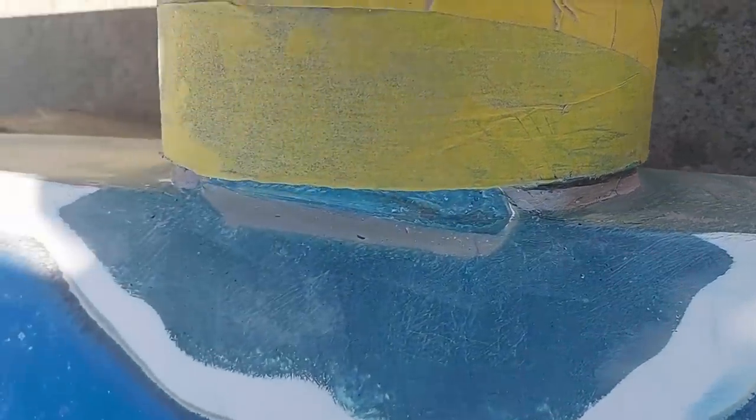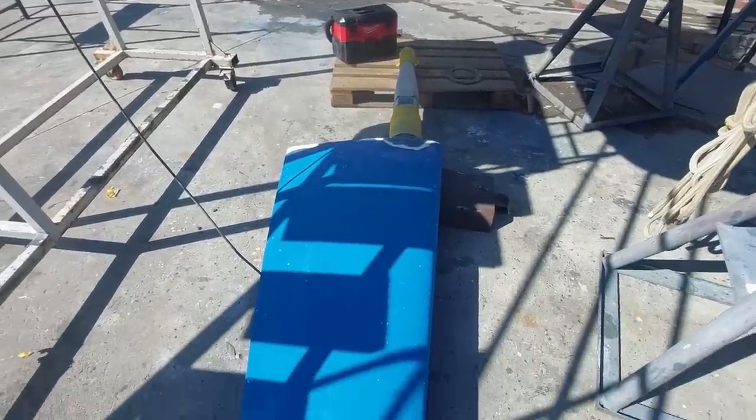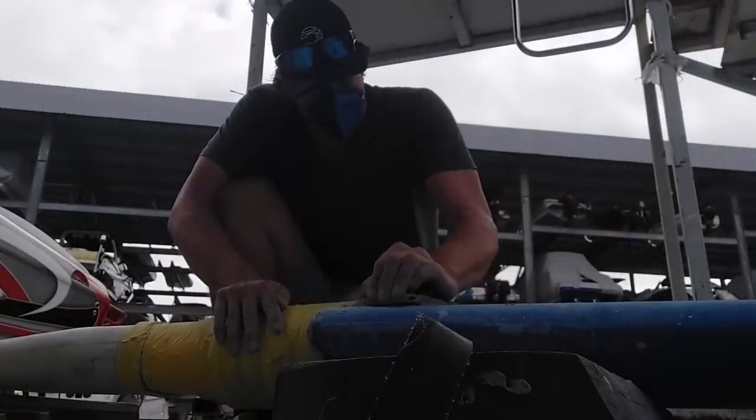There was just a little bit of absolutely normal cracks and some filler epoxy, and we took care of those, refilled it, and actually strengthened them back up with a few extra layers of glass. So the rudder is super strong now. We just need to wait for it to cure and do a little more fairing. So now it's just a matter of finishing all the projects, cleaning things up, and a little bit of paint, and then we can go back in the water.